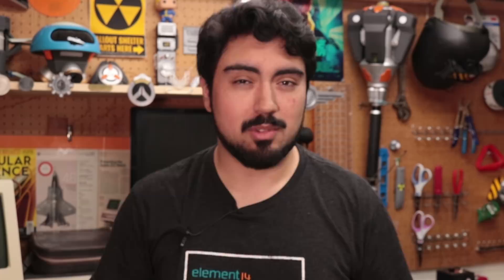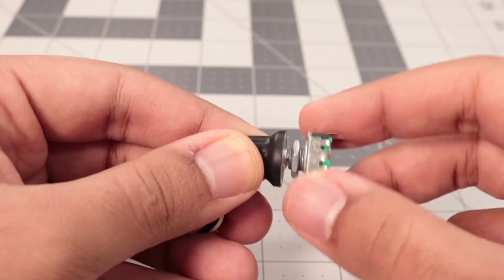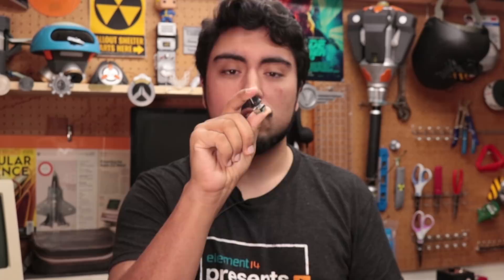We'll need something to touch to control the flow of our GUI. We're going to use a rotary encoder with a built-in push button, as well as a panel mount push button to act as our cancel switch. We'll use the encoder to scroll through the menu and confirm selections, and the red button to cancel. We just need to choose one more major component — I chose the other components first because that allows us to figure out our average power consumption. I've selected a 24-volt power supply which can supply nearly 10 amps, more than enough for our motors and certainly more than enough for the microcontroller and OLED.